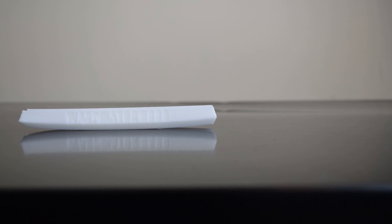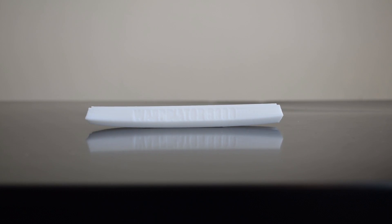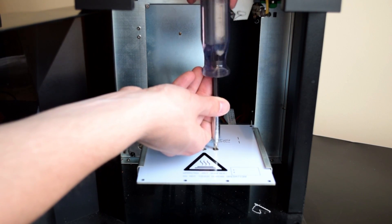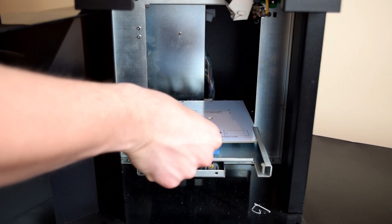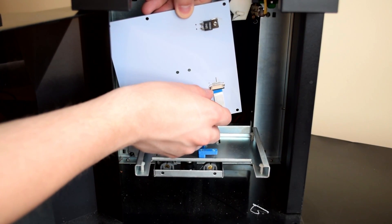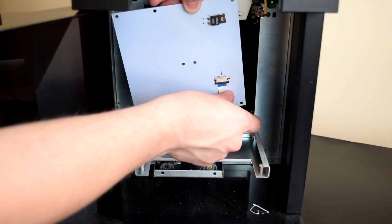The top of the print is fairly flat but still a little bit bowed, meaning even after the print was complete it was still contracting and warping. So yeah, that's a pretty bad print. Taking the UP Mini bed out is a nice and easy task — simply undo two countersunk screws and slide the bed either backwards or forwards to release it. The thin ribbon cable supplies power to the bed and is really fragile, so carefully push the locking cover free and remove it.